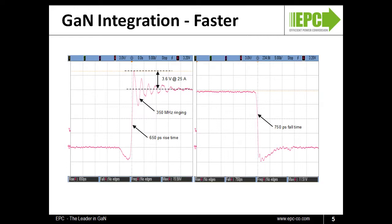The reduced inductance, coupled with an optimum layout, enables very low voltage overshoots: 3.6 volts at 25 amps with a 12-volt input. This low overshoot means that our 30-volt half-bridges can comfortably handle input voltages significantly higher than comparably rated MOSFETs, due to the inherently higher overshoot of a circuit using the larger and more inductive silicon devices.